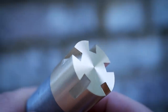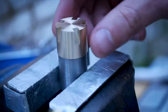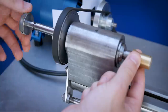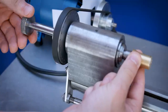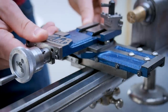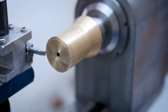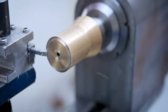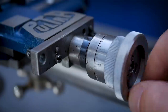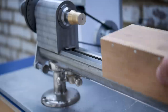So now we have our shaped grooves, we can remove the workpiece from the superglue arbor with a sharp tap. The next step is to make a special superglue arbor. This is in fact the exact one I used in the watch gear video, and as I explained when I made it then, I made it too long so I can use it multiple times and for other projects such as this one. This needs to be made to locate in the shaped grooves.